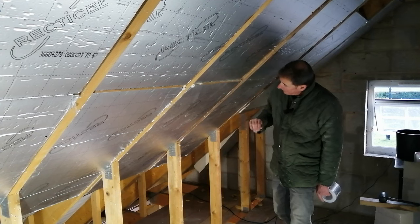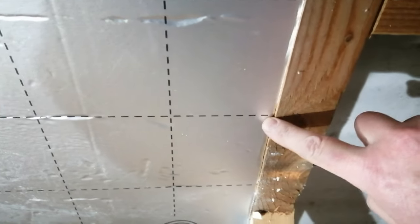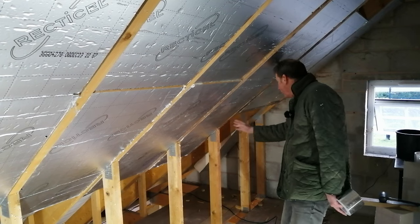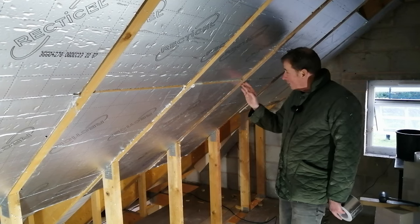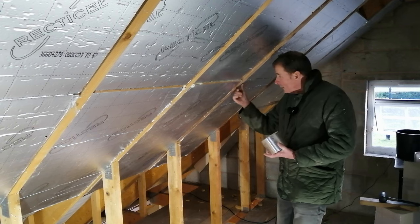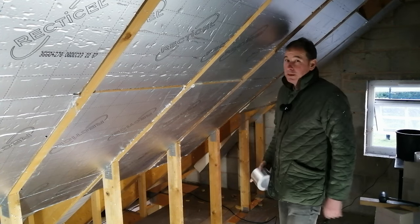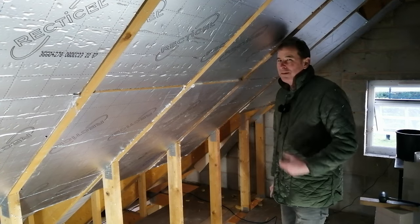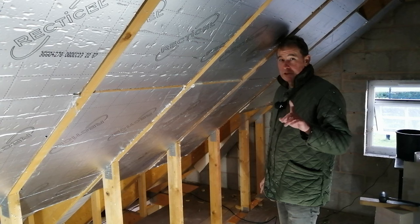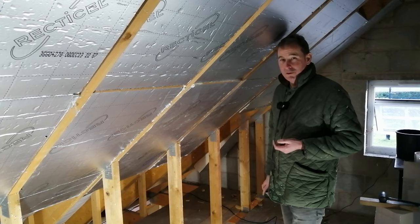That is a perfect fit — a lovely snug fitting piece of hard insulation board. The reason it fits snugly is because I got great right angles and was accurate with my cutting, so very little air will be able to come through and form cold bridges, which prevents cold spots on the inside. All the gaps and joints will be covered in aluminium foil tape, and on top of that there'll be even more insulation in the form of insulated plasterboard. Hope you found that useful — if you're a professional and want to add more value, please comment below. See you soon for more garage conversion adventures!